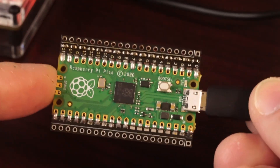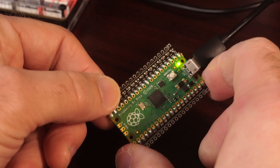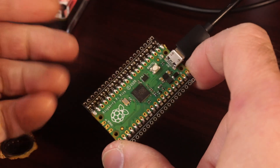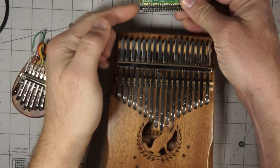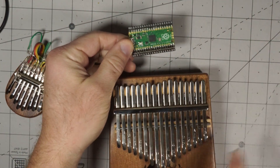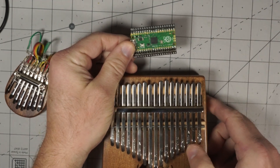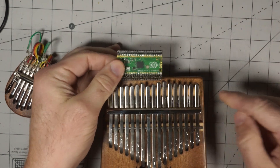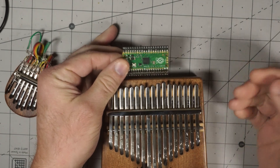Just want to say thanks to PCBWay for sponsoring this video. Each one of these has a one mega ohm resistor. It's hooked up to GarageBand now, which recognizes it as a MIDI device. The idea is I could pretty much just run wires from here to the kalimba, but unfortunately I only have 16 I/O and there are 17 keys — it seems like you always need one more than you have. If this got popular enough, I could make a PCB that fits right on it and make the contacts there, but I'm not going to do that, at least not yet.